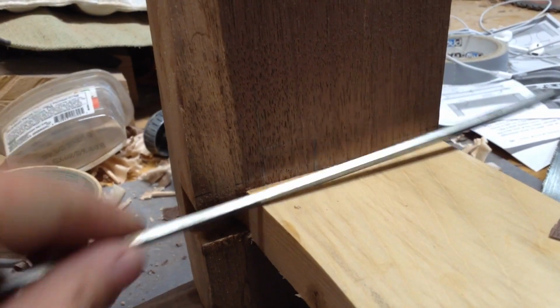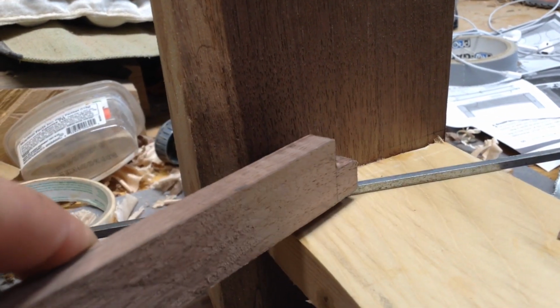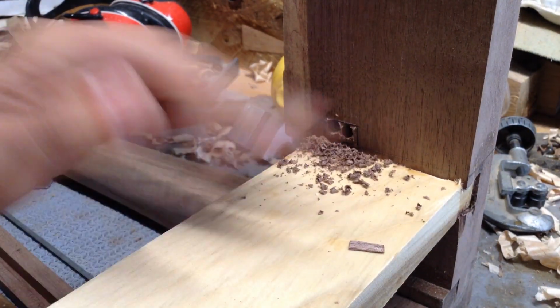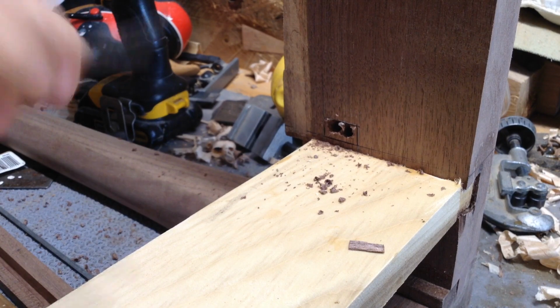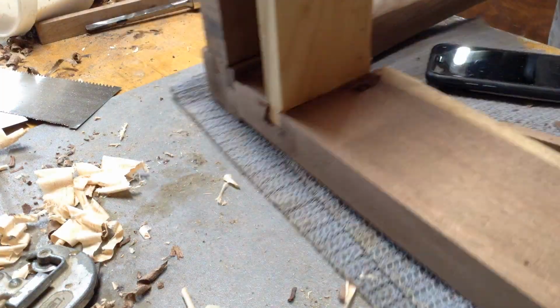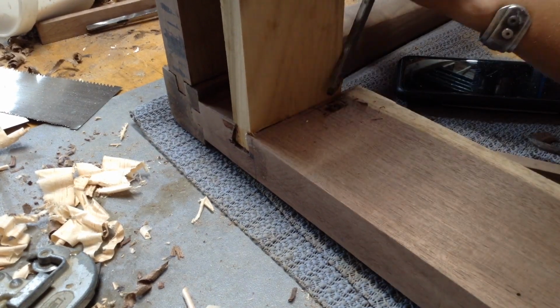So this is where I fix my 1/8 inch difference. You could see that the mortise I'm cutting in the back, and this is a little 1/8 inch piece of key stock, it cheated an 1/8 of an inch up. And then I could draw my lines for mortising that out, and that's how I ended up getting these pieces square. In the back, because of the angle, I used a drill to remove some of that excess, and then I could come in with a chisel and mortise out the rest of it.